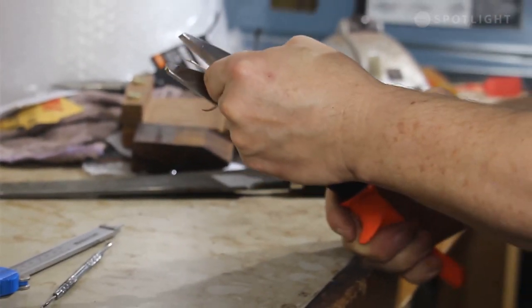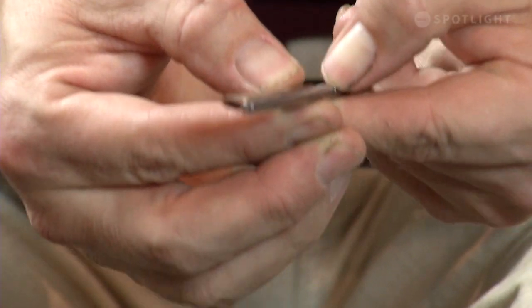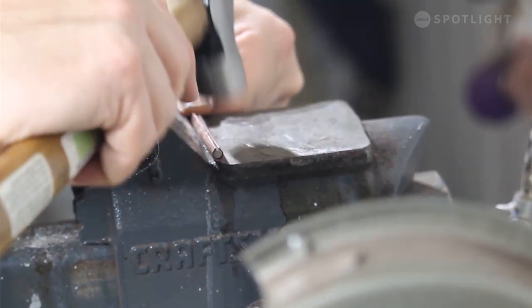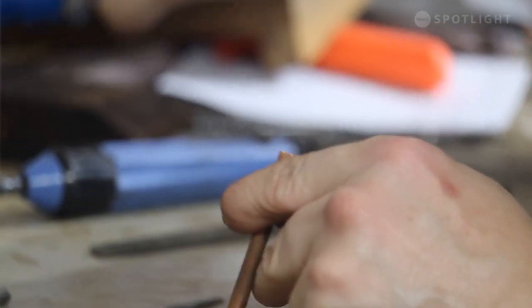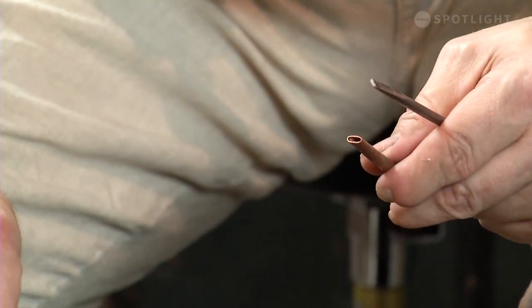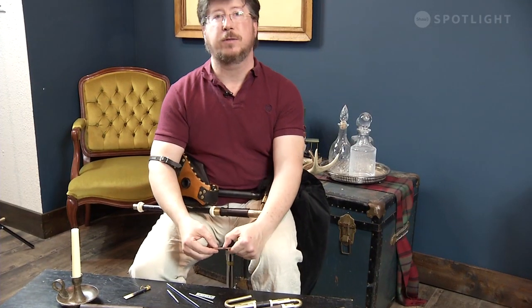The taper actually keeps the second octave in tune with the first. I scribe the pattern onto the little sheet of copper and cut it out with aviation snips — it always comes out a little proud of the finished dimension, so I file it down exactly. The little copper sheet is then wrapped around a mandrel that has a precise taper along its length. I roll the copper until it completely wraps around, and as you keep rolling and working it, the copper will actually close along the edge. Then you have to crush that little eye shape using a mandrel with flat sides, squeezed down with a pair of pliers.